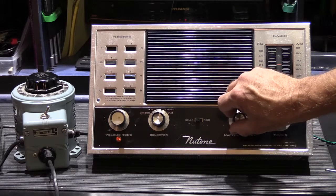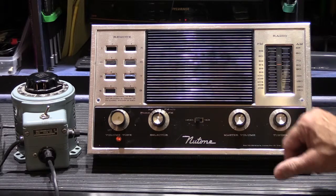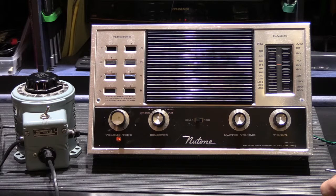Now I'll go ahead and turn it back down. Reception after the rebuild is fairly equal on AM and FM, which is what we're looking for. Since these early models — if reception is fairly close and fairly clear and you can receive most stations up and down the dial — we don't mess with them a whole lot. There aren't many adjustments as it is, and if it works well, oftentimes it's best to leave well enough alone. So this was a very successful rebuild.